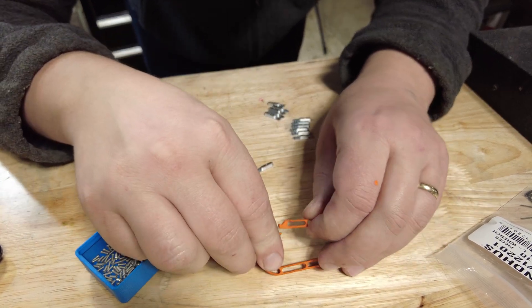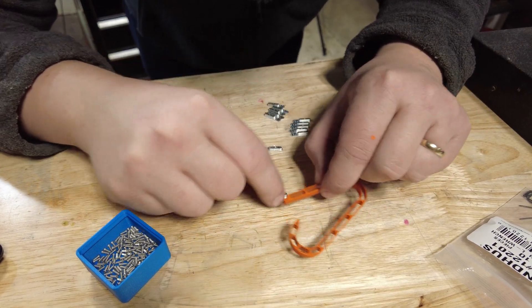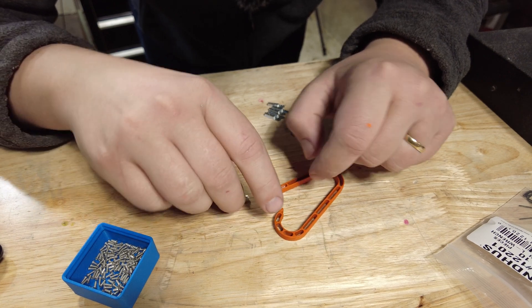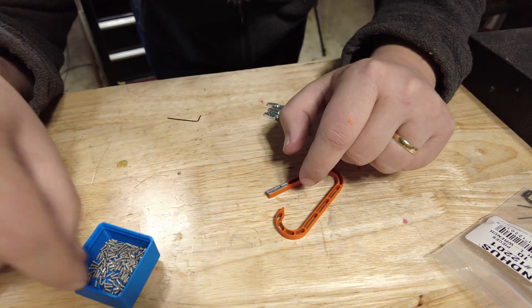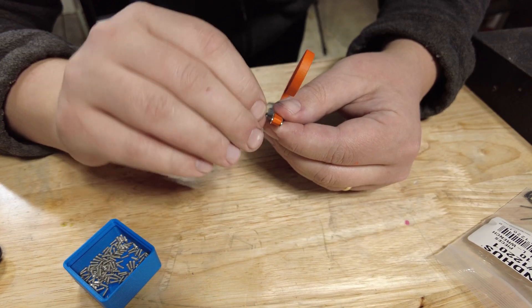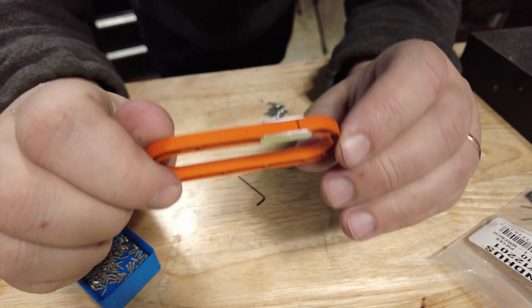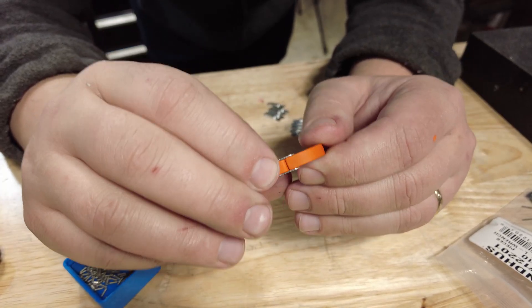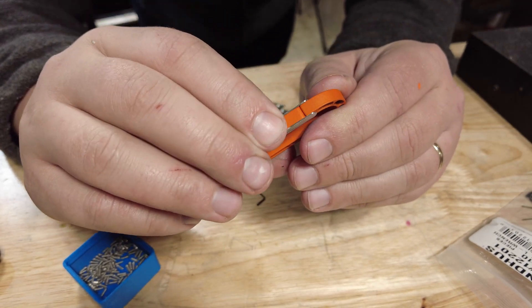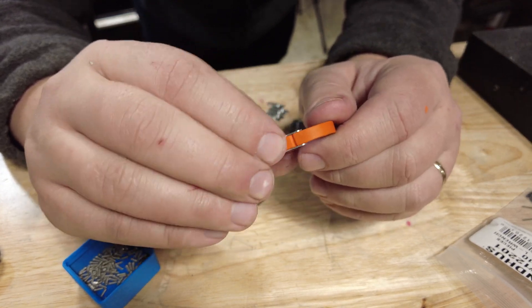Let's see if they fit. One end should fit there — I'm doing this upside down — this end should go there. It fits. And then we can take one of these teeny tiny screws and put in the teeny tiny screw. I can't believe it worked that well. It makes a little bit of a clicky noise because the aluminum parts are hitting on the carabiner unless it goes in dead straight. But if I put a little bit of a chamfer on there and give it a head-heavy tumble, maybe even just the tumble will be enough for it to guide itself in. I made some minimal changes to CAM to get better finishes and added in one salami slice this time.